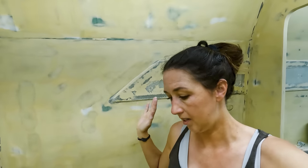So once I prime those areas with an epoxy primer, or anything that needs to be touched up, I can go back with the epoxy fairing compound, which personally I like working with better. So that's just going to be something done in this area, as well as trying to do this last seam on the outboard side of the shower. And then this whole hull should hopefully be ready for a new coat of primer in the next couple of days.